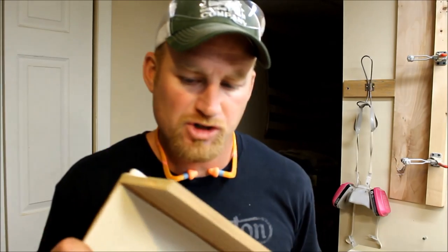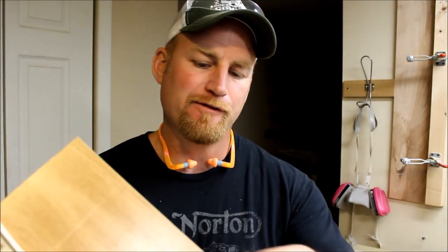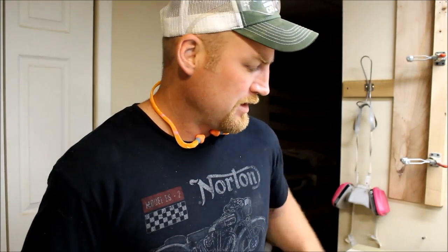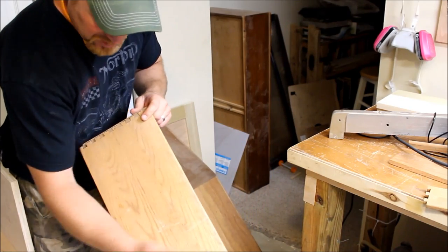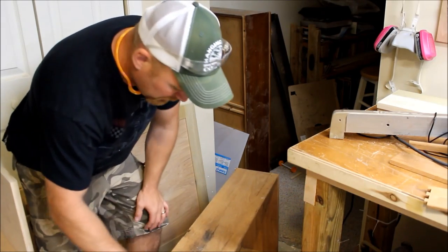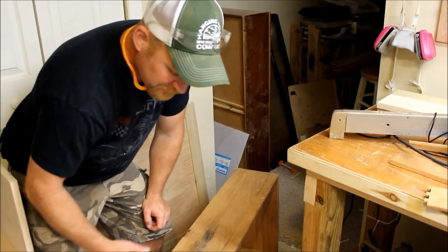I had to find something that was a half inch that could fill the front of these drawers. I didn't want to use half inch plywood because I wanted it to match this faux oak grain they have on here. These look like oak panels, but they're actually just particle board with a plastic-type oak veneer. As I was trying to figure out what to use, I stumbled upon these half inch oak boards that came from drawers out of a giant chest of drawers I found on the side of the road. I have two more of those over here. The reason I kept them is because they had solid oak panels on the sides and the back, and in this case that's going to be perfect — I can cut these up and use that as the front panel I need to fill in for those drawers.